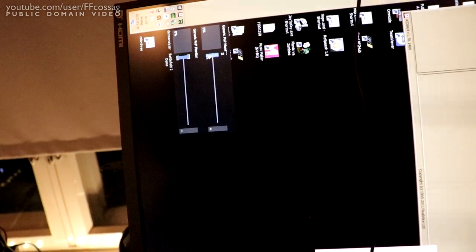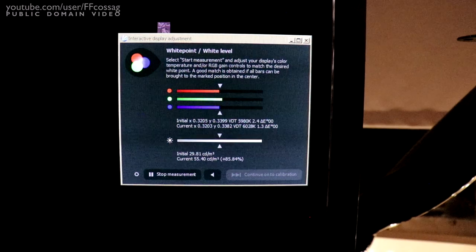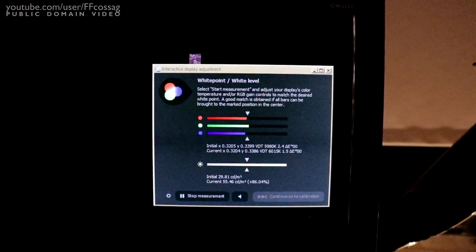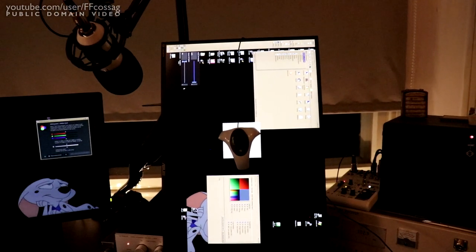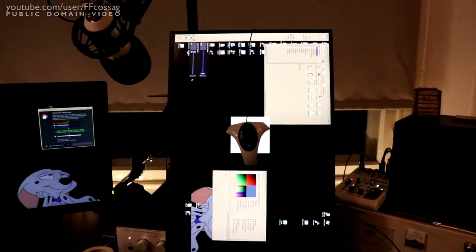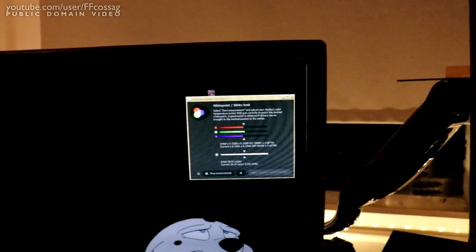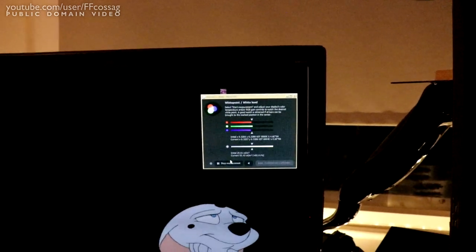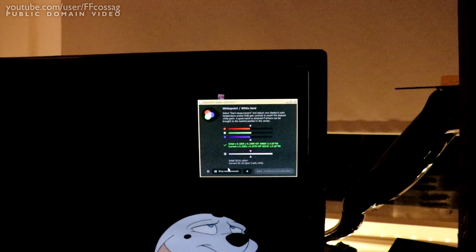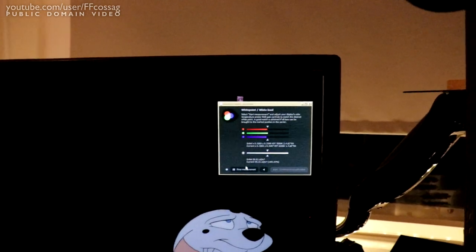Brightness from brightest to dullest, so this should bring us up to about 100, maybe. Nah, we get about 50, 55. And that might be perhaps a tad on the dim side. I'm going to have to think about this for a moment. Perhaps we'll go down to 10K on the resistor. I know that this monitor has a really good range. It could be ever so slightly brighter and I'd still be fine with it, so I'm going to use this guy for a reference. If this does a 30 candela minimum, or if it does a bit less than that, I'll just make a bit of a comparison and judge from that.